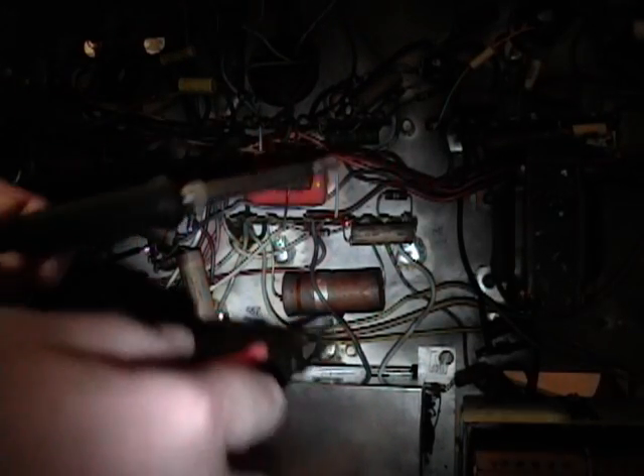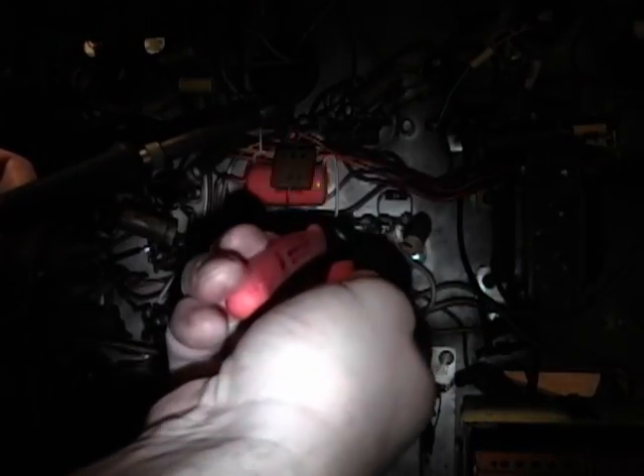Now to unwrap the leads using a really small pair of needle nose pliers, get in there and unwrap them. Same with the resistor, and one more. Once I've got these off, I'll clean up the terminal a little bit too because there's usually a lot of flux left behind. They can be tough to get into sometimes — that's why in tight quarters I use the pigtail method. All right, there we go. I'll clean off the other lead, then wrap on the new parts and show you the final results.